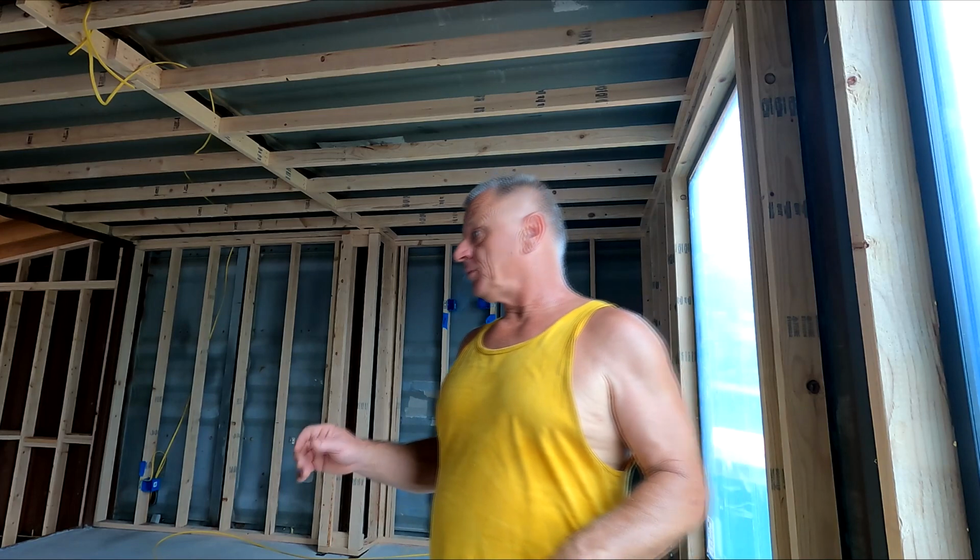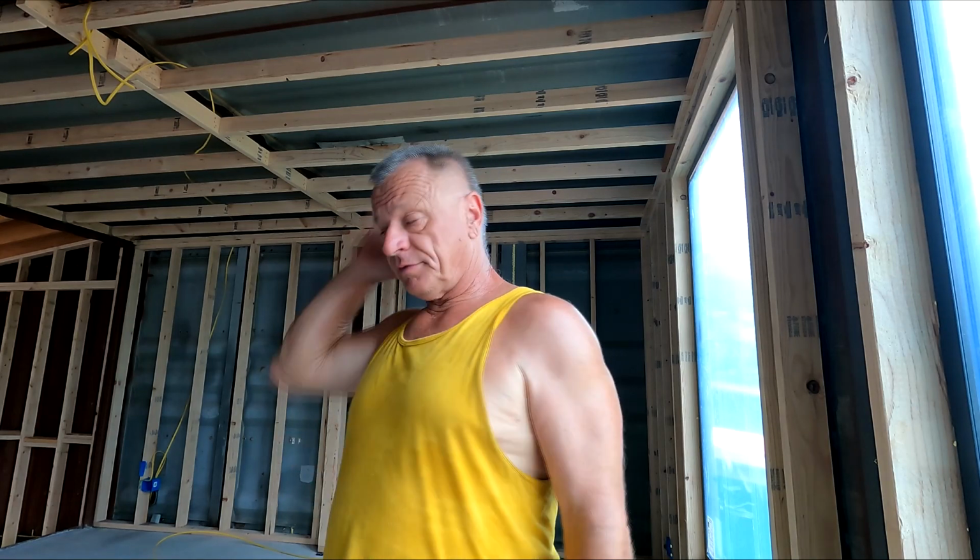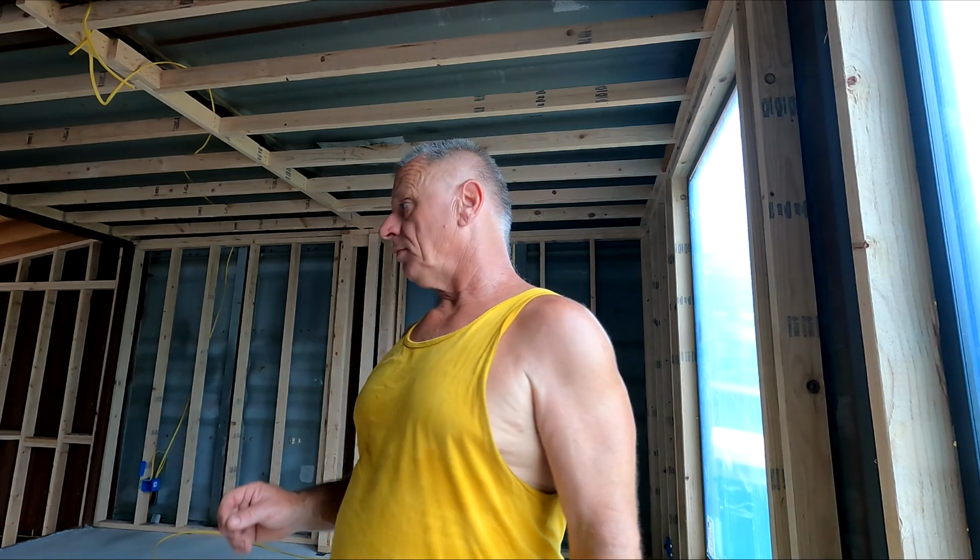Anyway, shouldn't be too bad, but the fun part's going to be busting through the concrete. I do have a nice hammer drill, a big one for that, and a chisel, and hopefully we won't hit the cross piece metal parts. I'll measure for that just so we don't hit it, because that would make our lives a little harder. I'd have to cut through the metal or just move over, but it should be straightforward making the hole, and then figuring out where to run the wire.